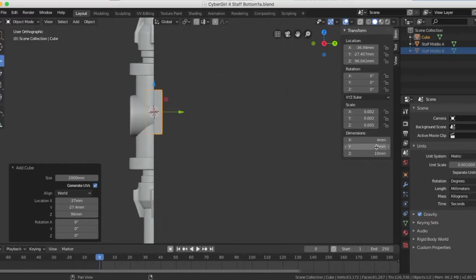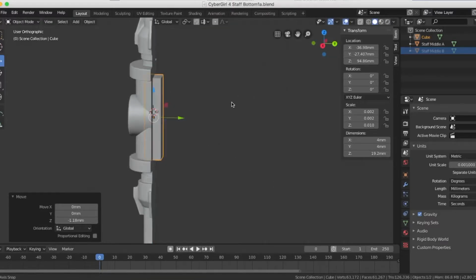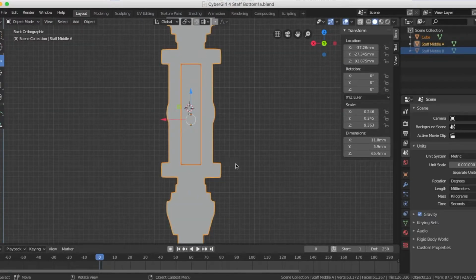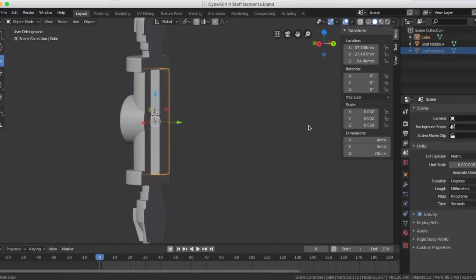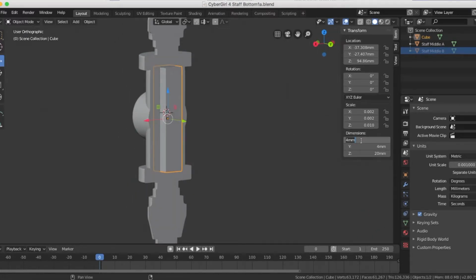And you got to be careful when you do this that you don't go too close to the edges. Cura can be difficult. I'm not sure about other slicers, but if you come too close, it actually will show up as a hole. It'll only print so thin, and then it becomes a hole, even if it's not really a hole. You know what I mean? If a section of the mesh is so thin, it becomes a hole, even though there's something there.